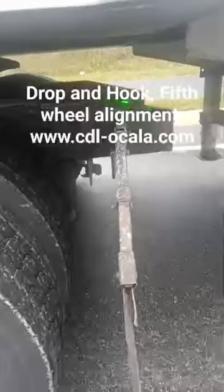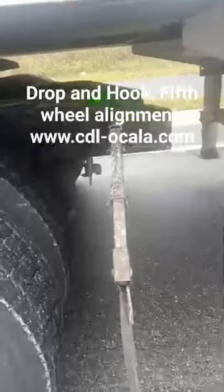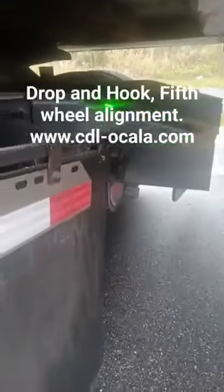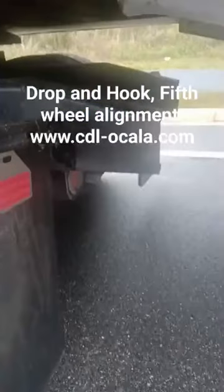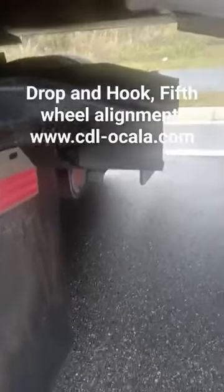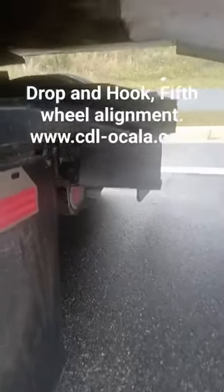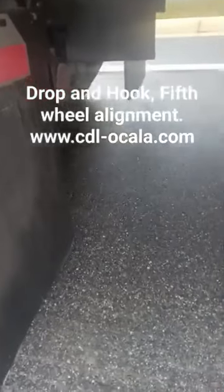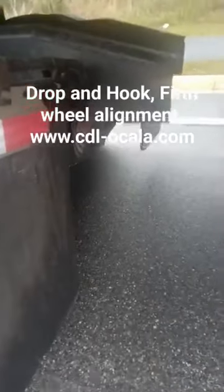This here is made to be able to get underneath a trailer. That's why they have that slant. Some of them, if you look at the switcher trucks, are completely reinforced. This is good here because if my trailer slips really bad, I can probably get underneath it, or get underneath a low trailer, bring it up off the ground, and let the air ride, the leveler, adjust and push the trailer up. And then you can lower the landing gear little by little.